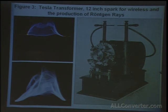The primary of the transformer, and that's the Tesla coil, is copper sheet, and taps are made at various points for varying at will the number of turns. As in figure 1, the inductance coil is wound in two sections to adapt the instrument both to 110 and 220 volts, and several secondaries were provided to suit the various wavelengths of the primary. The output was approximately 500 watts with damped waves of about 50,000 cycles per second.